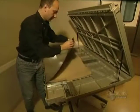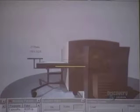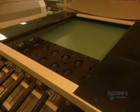All consumer products are packaged, and the making of these packages starts with the burning of an aluminum plate. This animation illustrates the burning process — the transfer of an image onto an aluminum plate. The plate is placed onto a cylinder, and using a laser, the burning begins. The image appears in six minutes. This plate will make the printing impressions on packages.